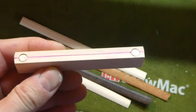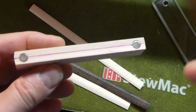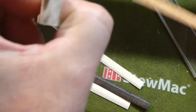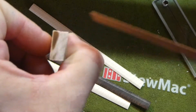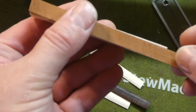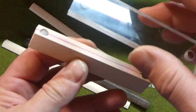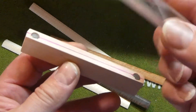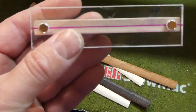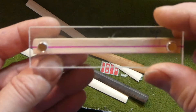What I'm going to use to fix this is a homemade jig with a couple of magnets you can get from Lee Valley Tools here in Canada. I cut a little curve on the bottom side of it that will fit the cleat. I'll cut the cleat to length, and then the magnets will align. You can see how I've got a piece of plexiglass — every time they should align just perfectly, so you don't need to go in there and feel for where the crack is. The magnets will just know.